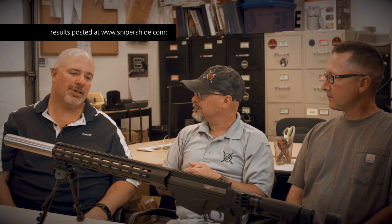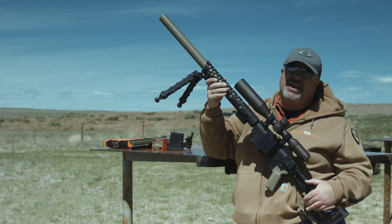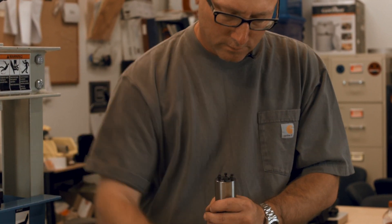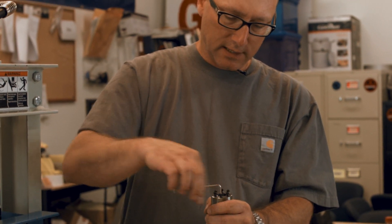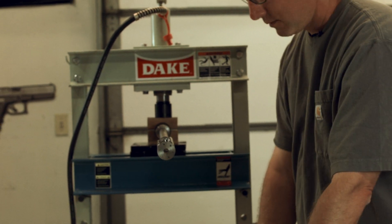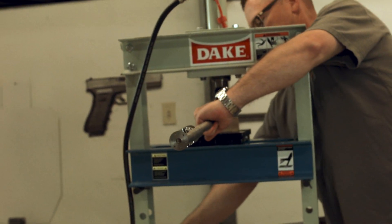Just back to the accuracy — one last thing. I saw it the first time I shot the .308 prototype system. The actual screw system and the way that Ken builds these — where they bolt the barrel together to the titanium sleeve — actually made the gun act more like a bull barrel gun and achieve that level of accuracy. Just like you said, we can throw away all discussion about the quietness and sound suppression: these guns became more accurate as we added the sound suppression system to them, with the exact same factory barrel. As a precision rifle shooter, a lot of guys use factory Ruger barrels — and these guys modified the system to work with the Ruger barrel.